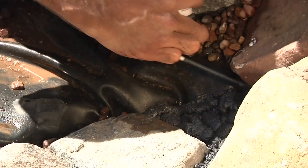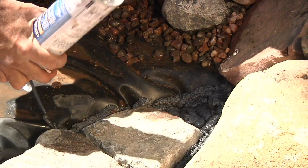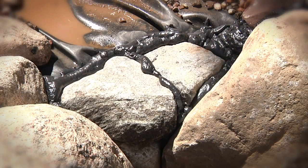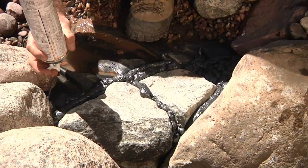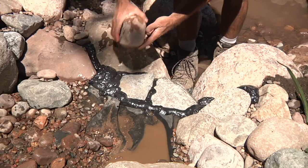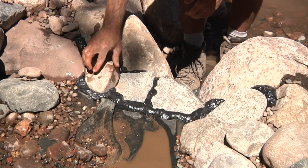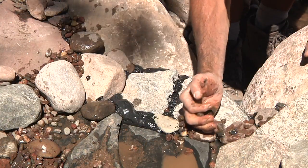Shake well and hold the can upside down to apply the DIY foam over the rock and gravel fill, understanding that the foam will expand once dispensed. Continue to foam between the waterfall framing rocks, along the stream edges, and anywhere else you feel that the water may be lost. Strategically place larger stones and gravel on top of the wet joints to help disguise it, and allow roughly 20 minutes for curing.